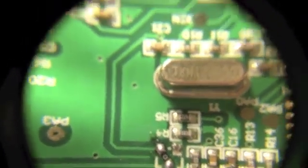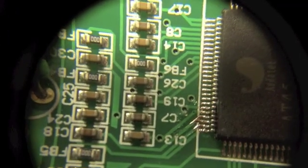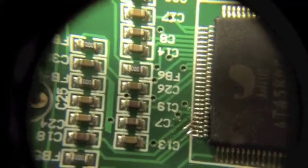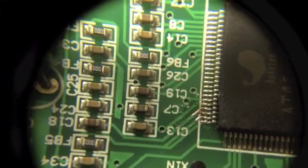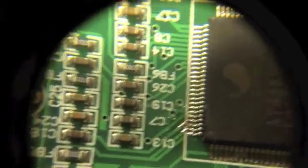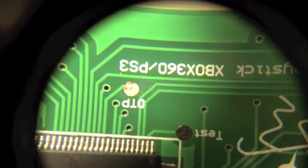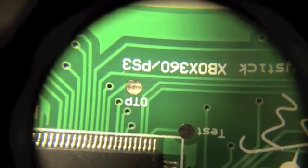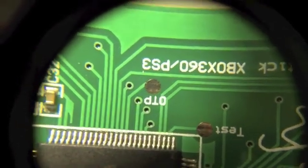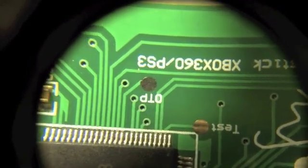That's just a guess. You can see some indication — look at this soldering, it's all over the place. Good thing those pins were supposed to be connected together, because now they are. And there's also a test pad with its dedicated pin, which I'm pretty sure is a serial port. It may be interesting to probe it and see what comes out.